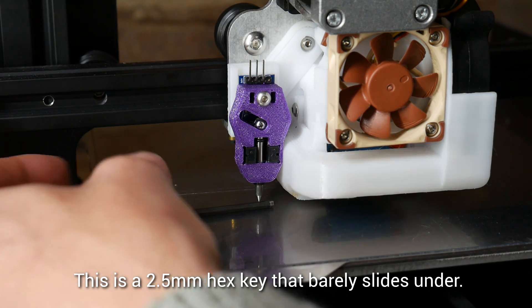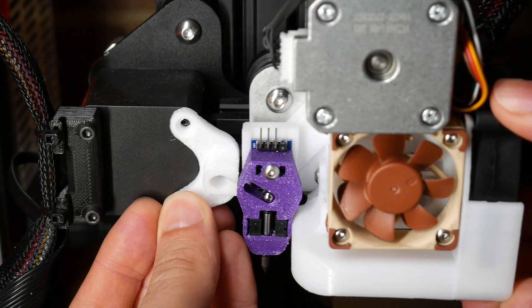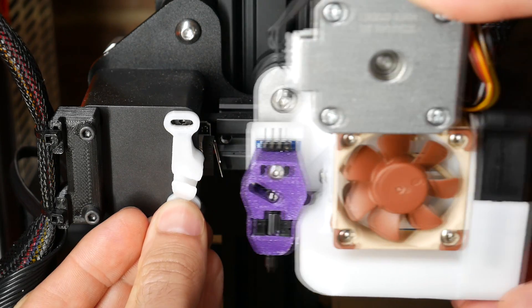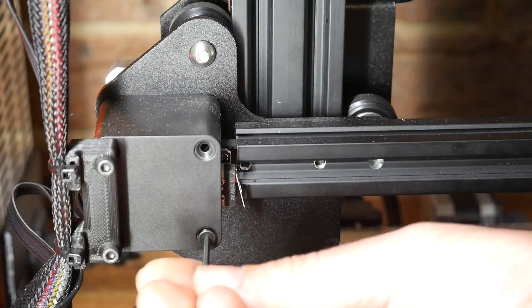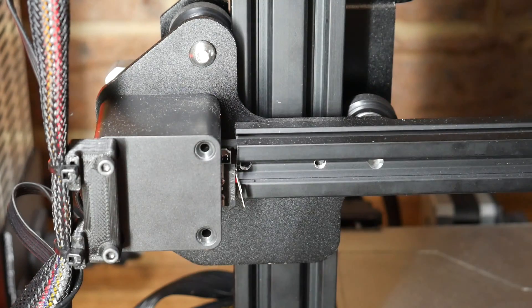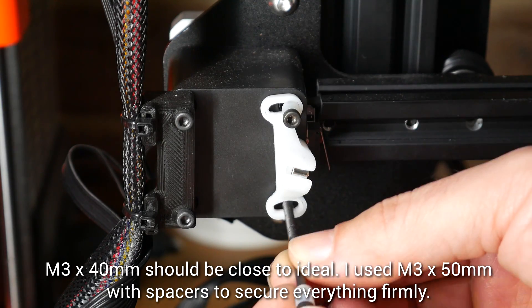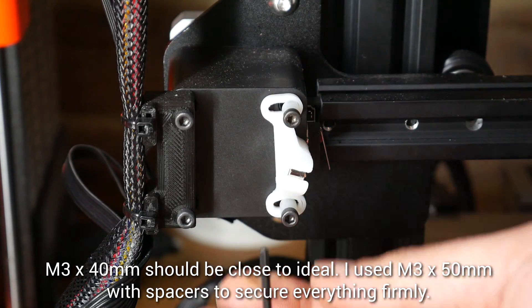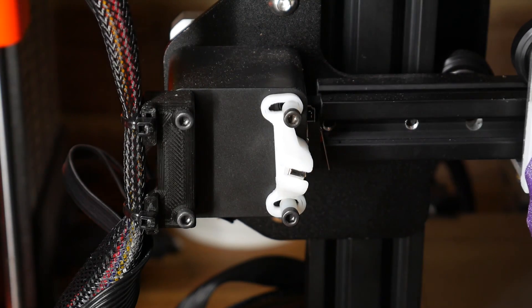Your results may vary, so check out all the links in the description. When mounting the strong magnet on the left, I again needed to explore several options. The one linked in the instructions for the Touch Me protruded too far with my Hero Me mount and therefore the printer wouldn't be able to home. The other ones I have linked in the description were pretty much perfect and they're adjustable. To fit them, you undo the two screws on the right hand side of the cover, but I found the bolts were no longer long enough, so I used M3 by 50mm bolts with small spacers to secure everything tightly. When homed, the magnet is pulled up and the pin is free to drop down as the carriage moves away to start probing.